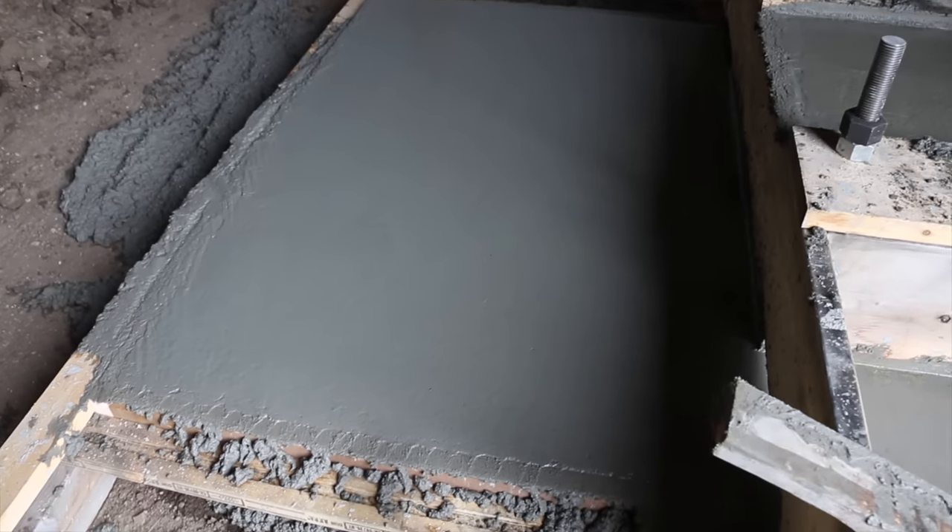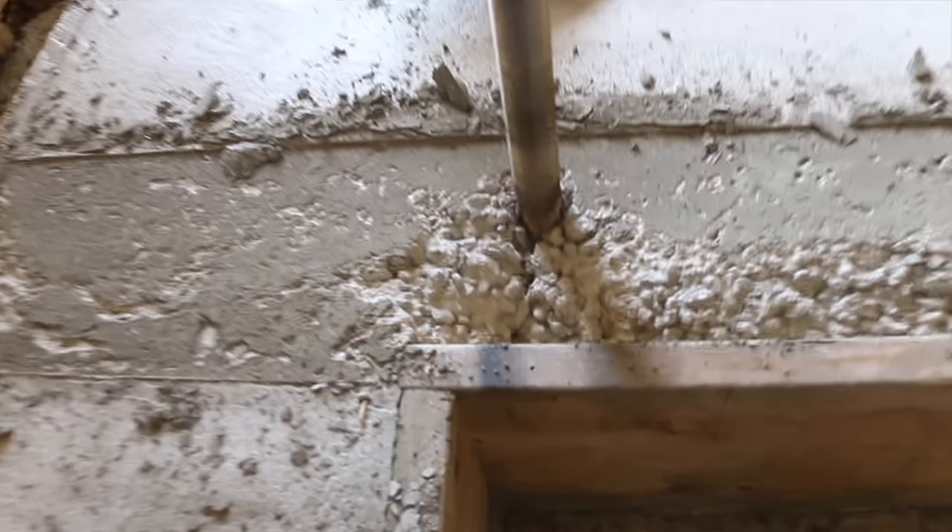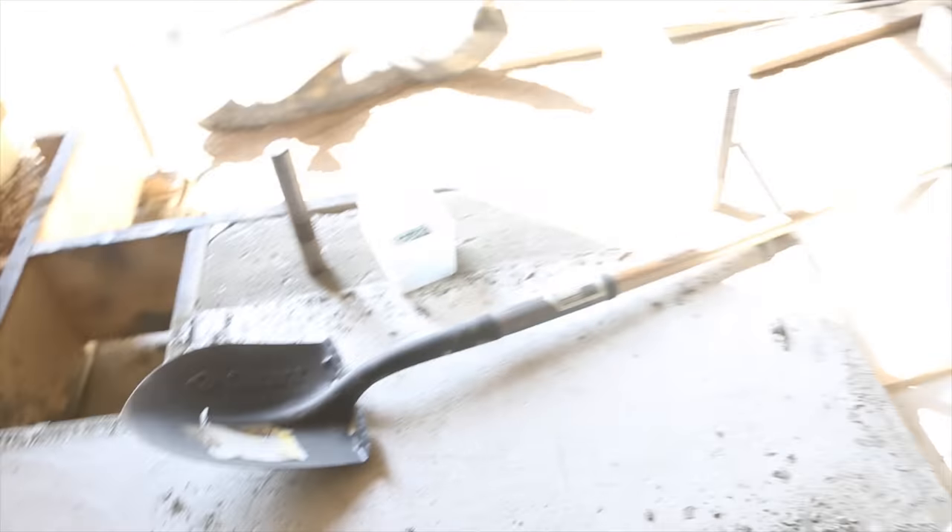I'm going to let this sit probably for a week before I knock the forms off. Once the forms are off, I still got to let it sit for another 30 days from now when we poured it. And then I'm going to put on some leveling epoxy right on the top because I know no matter how good we try, nothing's ever going to work out perfect. I've done that on the last two power hammers — just saying that as a disclaimer. So it's been a week now and I just started pulling off the forms and I got a huge, huge mistake. This is super bad. Look at this. The other side's pretty good though. Totally should not have cheaped out — should have got a vibrator.